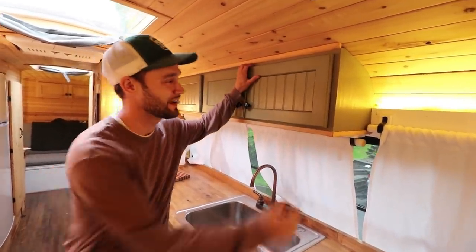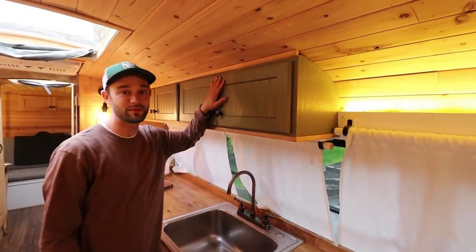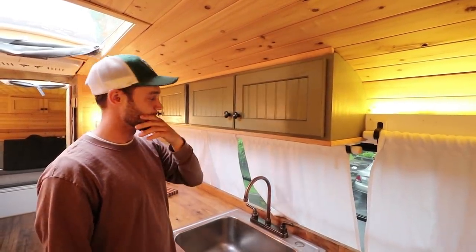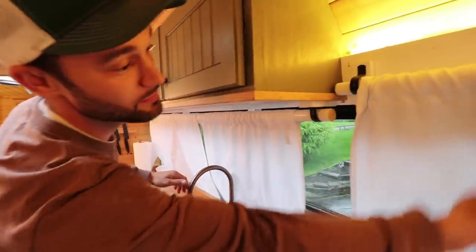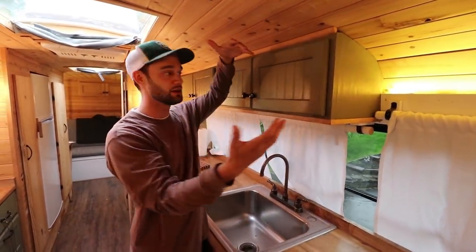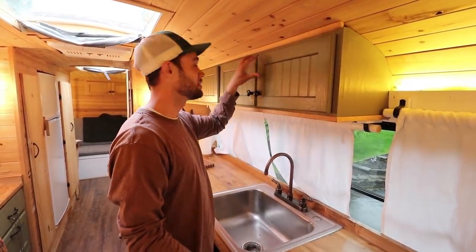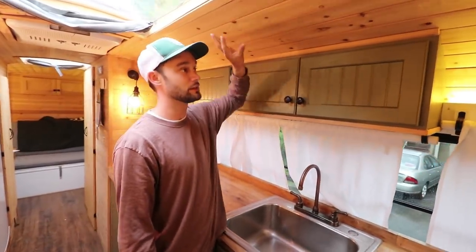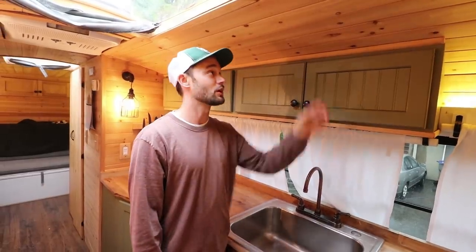I always get questions about how I attach the upper cabinets up here. I attached these top cabinets by putting a beam in the roof before I even did the ceiling, so I had an attachment point. There's a beam right here and a beam right here for the windows. You need to hit those beams — otherwise there's nothing to really nail to and these cabinets would just fall down. When I was designing this bus, I had to know where these were going before I even built the rest of the bus, because I had to put that framing inside the ceiling so I'd have something to put a screw into rather than just going into the really thin ceiling tile. As you can see, there are things to change and things I did right. Either way, this bus has served me super well in the last three years, and for driving about 70,000 miles, I think it's held up pretty well too.